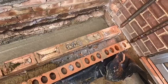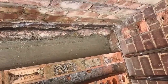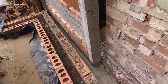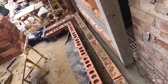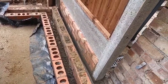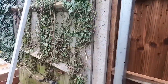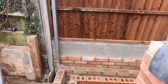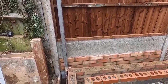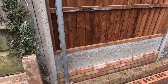This is what we did down here — got 75mm fall from there to there. Put this little bit of brickwork up there; they wanted the face side that side, they got it. Flettons, I know, not the best, but that's what they wanted. Gravel board and the fence panel back in. That's the party wall agreement satisfied. So now I'm going to get on with this.